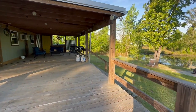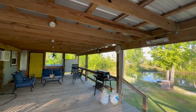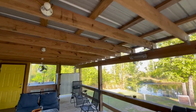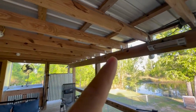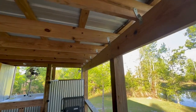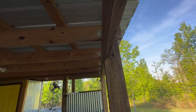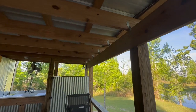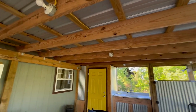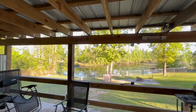Not pointing out any issues with this home — it's a little older — but this is something really neat that helps explain what all those little drawings mean: the Simpson strap connections at every joist, how it should be notched out to carry the loads of the two by rim joists coming across. This will help you make sense of all those little lines and notes on a piece of paper as they come to reality. I'm Leslie and I hope that helps.